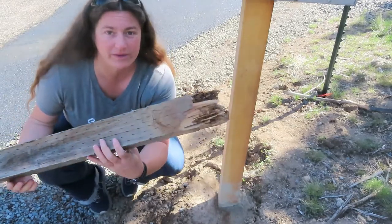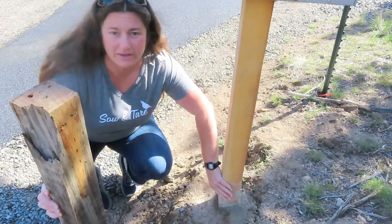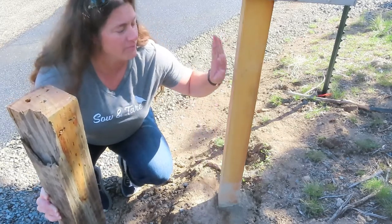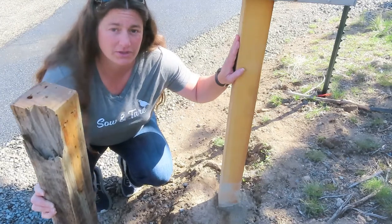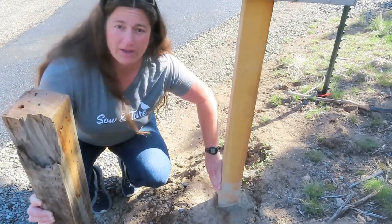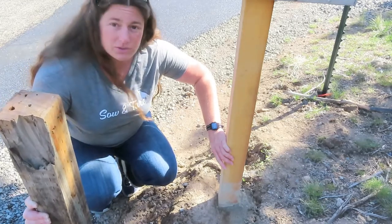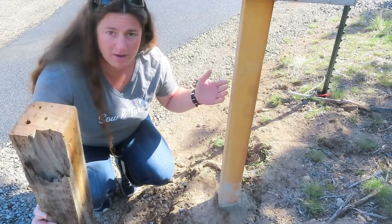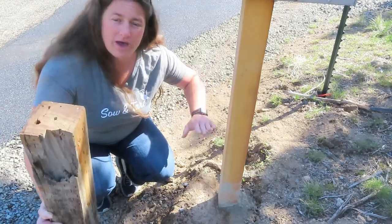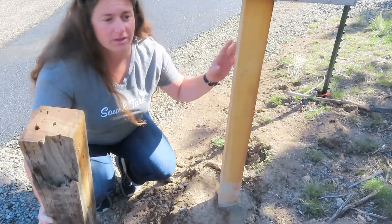This was the post that we replaced and this is how it ended up. We used a fence post mix or quick-set cement — that's the kind you can pour into a hole, so that's the cement you need. We used an untreated post just because that's what we had. When you bury a post, the part of the soil that makes the wood rot is the organic portion, and that's usually where it gets rotted.